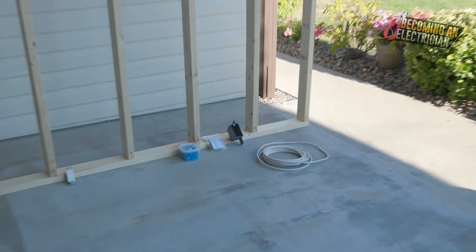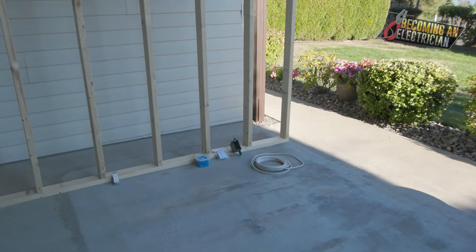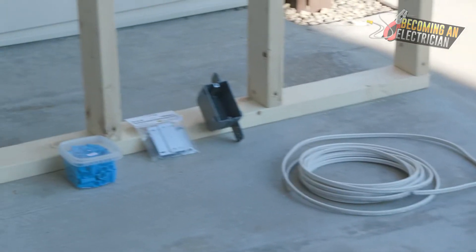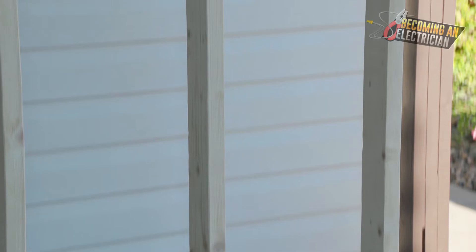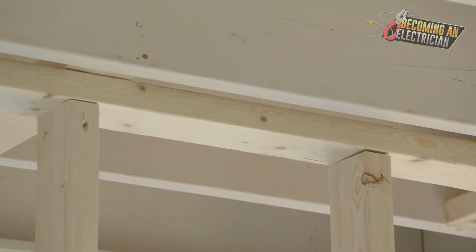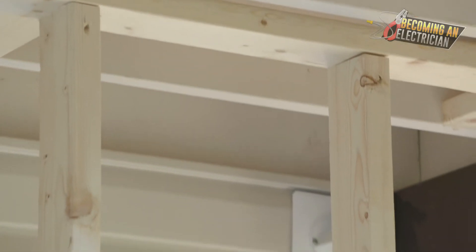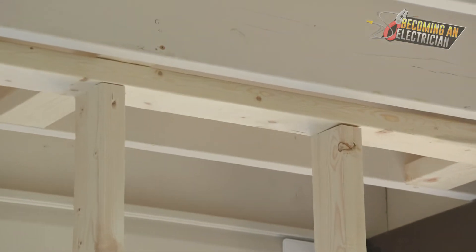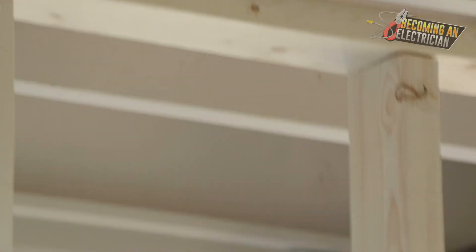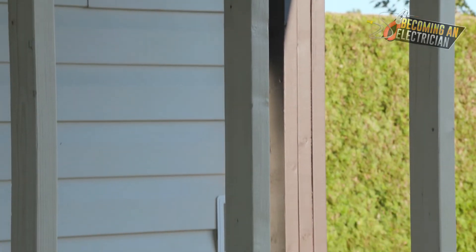Be on the lookout for more videos — I'll try to keep them short and cover how to install a box, how to staple wires, how to splice wires, and things to think about. For example, you should never run your wires on the top plate. If someone is drilling a hole they can't see your wire and they'll hit it. When stapling, try to stay more toward the middle of the stud.